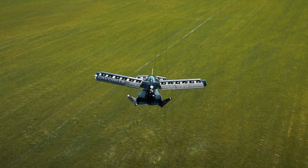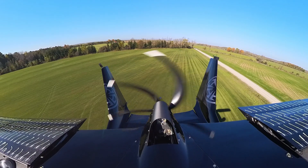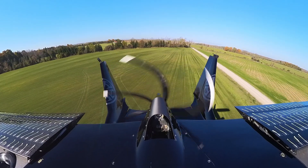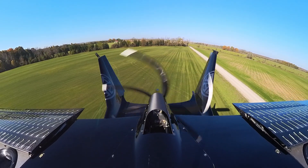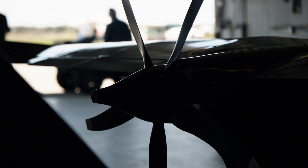We have talked about doing a parachute on our demonstrator aircraft for safety enhancement, but some factors of our airplane make it quite complicated to install. With the pusher prop at the back of the airplane and some of the nature of the surfaces, it becomes very complex to install. You end up with a fairly heavy system with not much benefit.